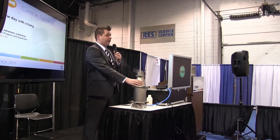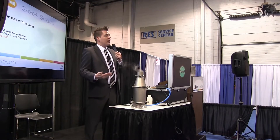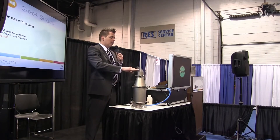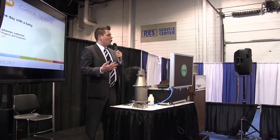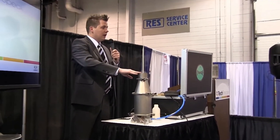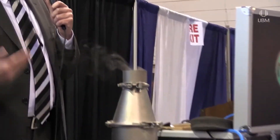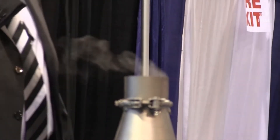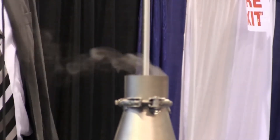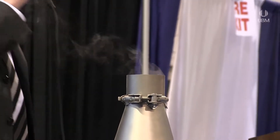There was a pressure rise inside this vessel of approximately up to 10 psi. The opening pressure of this aluminum foil was approximately 2 psi. So it opened and relieved the pressure, but it also relieved the flame. That's why the protection concept for installations located indoors won't allow just a standard relief venting.